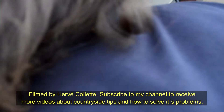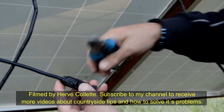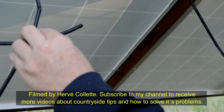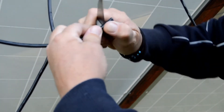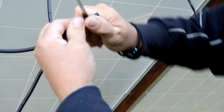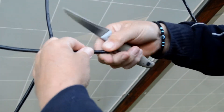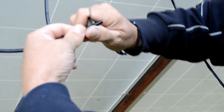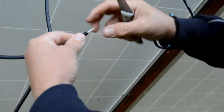Now I'm going to grab the other one. I will cut this one — there's no point opening it. With the knife, you cut about a centimeter of insulation and go all around. Be careful with the knife because it's sharper than expected. Sometimes you help yourself by twisting it a bit, and once it's nearly off, you give it one last go, twist it, and peel it away. And it should come right off.